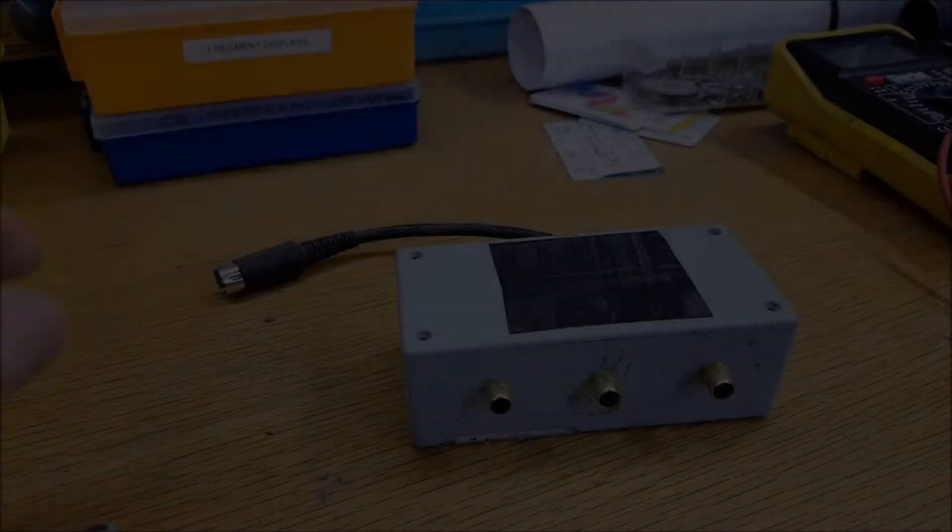So there's no physical connection. Why do we need that? We need that in the case where your amplifier, like mine, is old and it has quite a bit of voltage on the keying line. In my case it's got 28 volts on it, so the keying relay in the radio wouldn't last too long if you were to plug that amplifier directly into the radio and let it key it. So we're going to go about it in a different manner.